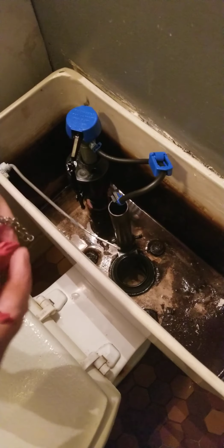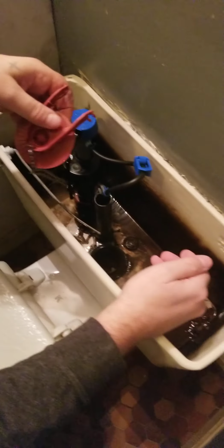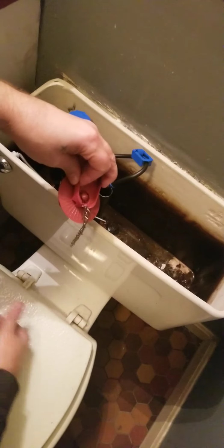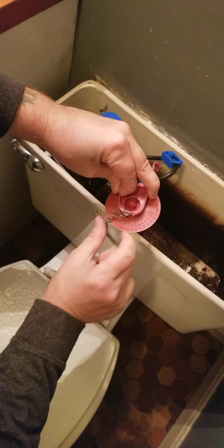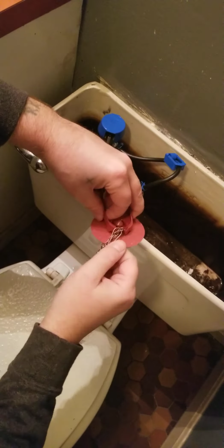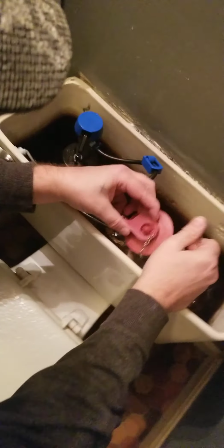All right, last but not least, I have an adjustable float flapper. Now this is numbered 1 through 10. I like these because sometimes you'll fill the tank with water and flush the toilet and the flap will either open and then close right away, and it won't let enough water down from the tank into the bowl to create the centrifugal force necessary for the flush, for that pull. So if you need this flapper to stay open longer, you can actually turn it and adjust the numbers from minimum to maximum. So it'll stay open longer, it'll stay open shorter, however you want to set it up. That's trial and error. Once you put this on, you make your flush, you'll have to start looking for those types of adjustments that might need to be made.